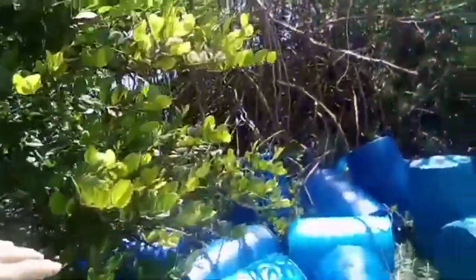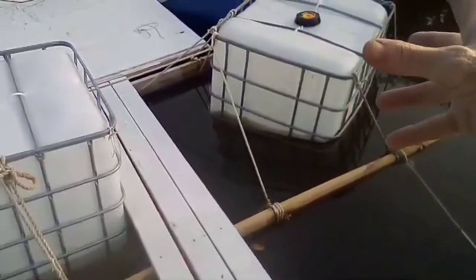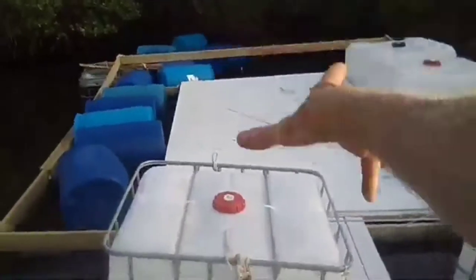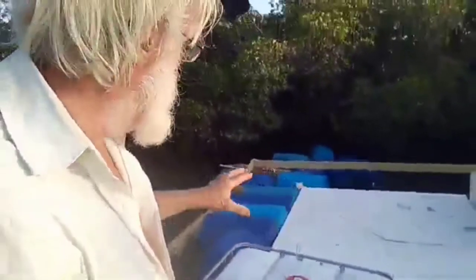Took the truck back. Here's my boat — drop my gear here, get my boat, take them out. What you see is I did go out and got these drums. You see the drums? What it is — you see that one is maybe collapsing because if there's a slight hole in it, the air can escape and the water can crush it. So what I'm going to do is take four drums and push them inside each one of those. They're airtight. I've used these drums before. One of them blew away — now I'm short one; I need 16. I got a good deal on them anyway. I'll be putting them inside, four in each, and then fixing them in the corners.